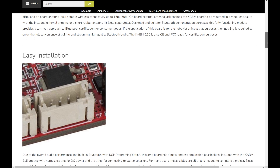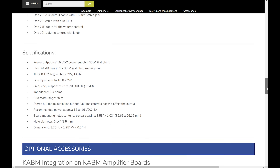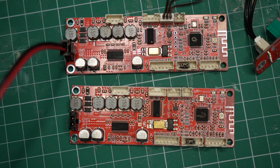Okay, so they do get hot — but can they get loud as well? Let's look at the specs. With a 15V power supply, the KABM215 can put out 15W stereo into 8 ohms, and the 30M delivers 30W mono into a 4 ohm speaker. Let's test this and see what we actually get. I'll be showing the 15W stereo board for this part of the video, but at the end I'll post the numbers I measured for the 30W board as well.